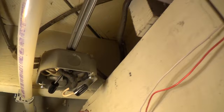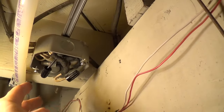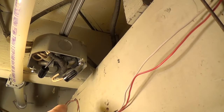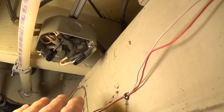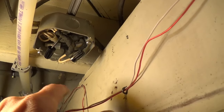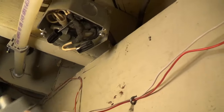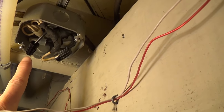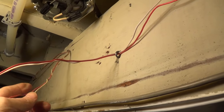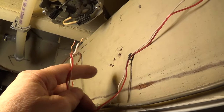Right here is where the transformer used to sit. The transformer basically reduces the voltage from the inline 120 volts down to about 10 to 16 volts, and that is what the doorbell runs on — that's what the transformer is for. The original transformer used to sit just like this and get power from these two lines, this white line and black line. So that would be the power coming into the transformer. Now these wires here go to the doorbell — these two went to the doorbell button and these two went to the doorbell chime.